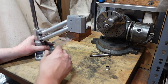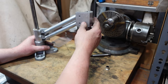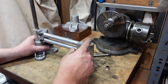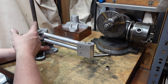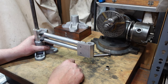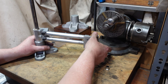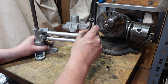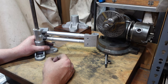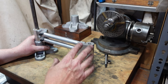My bracket here bolts down to the mill table, and this rod - I'm not quite sure where to cut it off yet because I was planning on having a stop there so it wouldn't go down all the way. At the moment it's a bit stiff; these things will take some time to bed in. The Teflon embedded in the bushing gets smeared onto the bolt over time. I've now got a bracket I can clamp to my mill table, with a hole that will swing around this central pivot and go up and down while remaining parallel to this rod - meaning it's always square to the mill table.